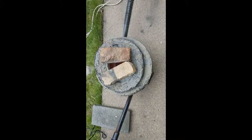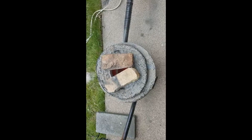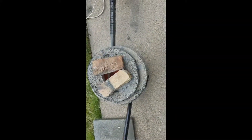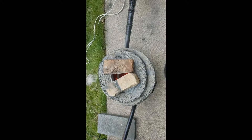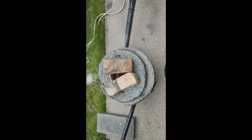It's only taken me about 30 to 40 minutes to heat this thing up. I've been going a little too fast — I can tell because I already cracked my cover in two different spots, so I'm going to have to remake that. This is the second time I've turned this on, so probably don't go this fast. Be patient, unlike me — it could take you 50 minutes to an hour to heat up your crucible.